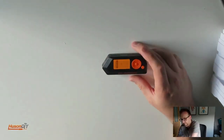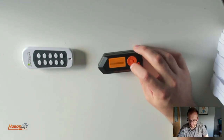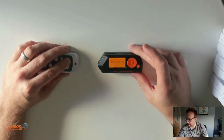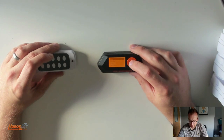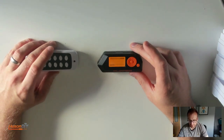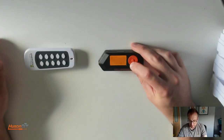So that's the remote control programmed. Next I'll go up to sub-gigahertz. I'll get my remote control and go down to frequency analyzer first. If I press something on there I can see it's jumping to 433.9 MHz. So I'll go back, go up to Read, and press number two on this remote — it beeped and came up with Princeton and the code. I'm going to save that as 'two' just to do it quickly.